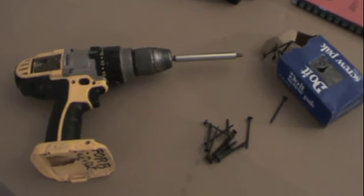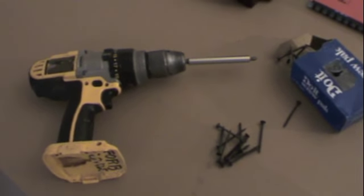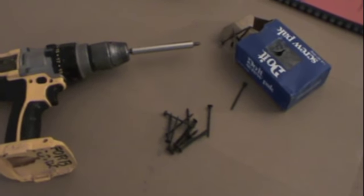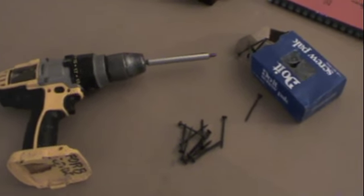The panels are going to be installed with a cordless drill with a screw tip extension. The screws we're using for the installation are number 6 or number 7 two-inch screws. This is important because one inch will go through the slat wall and the other will go directly into the stud.